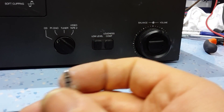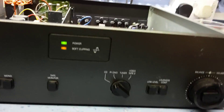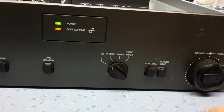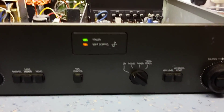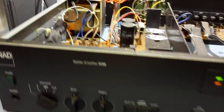And the right-hand channel — you can hear it? It's actually working. That's because it's passing most of its current through the drivers. There won't be any output capability in that amplifier channel, but it is working. So the next thing to do is replace the output stage. I'll get some transistors sorted out and then we'll rebuild the output stage.